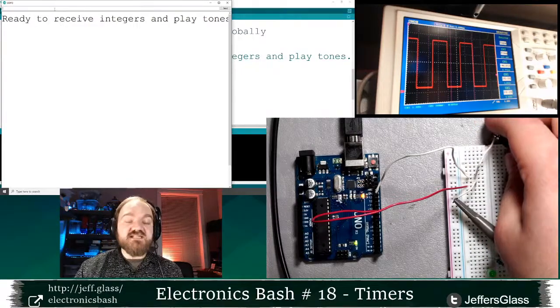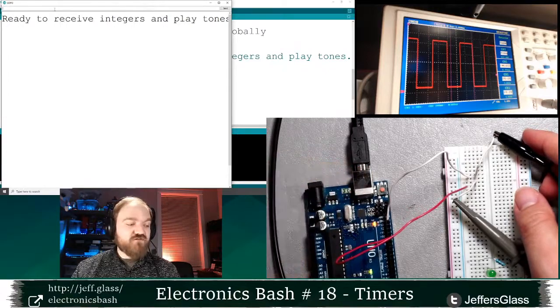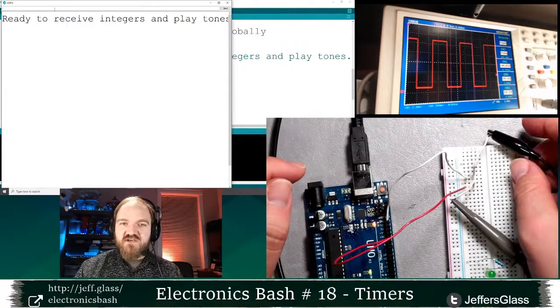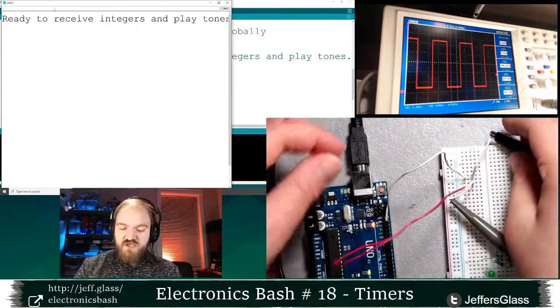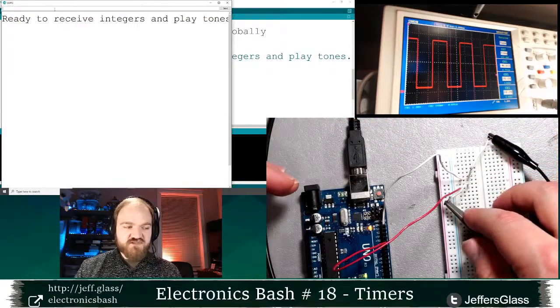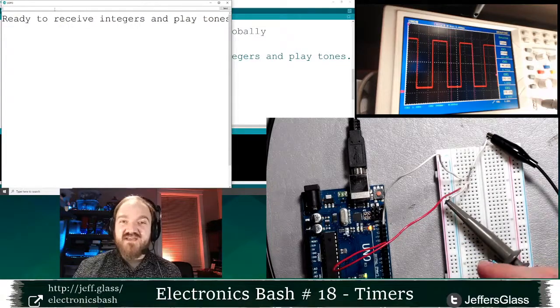What's happening here is actually that the Arduino itself is ground referenced through my computer because my computer is plugged into the mains power source, and the ground lead of my oscilloscope here is also ground referenced. It's connected to the ground through its power cord. So I'm actually not measuring across this little air gap. I'm measuring the distance from a common ground to this voltage. If I were to float one or the other of these things, it might not be as successful a measurement.